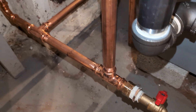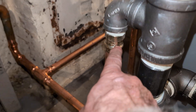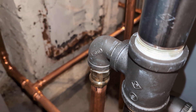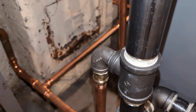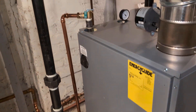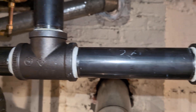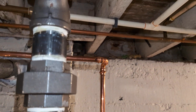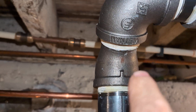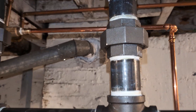Mostly a gallon at most. I come up with the copper, I have a brass adapter, and then it goes into a street one inch stainless steel L into the Hartford Loop. This pipe is pitching this way, and the small rear main is pitching in parallel flow. So there is a swing joint here which allows the pitch to be controlled within reason.